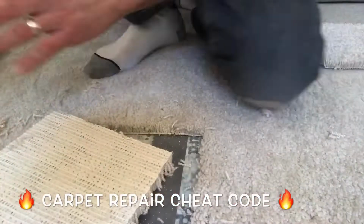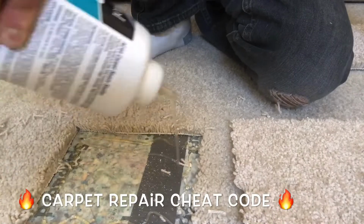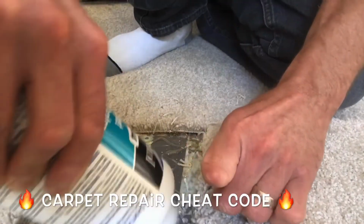in there. Once I traced it out with the screwdriver, I took a razor blade and traced that line to get a nice clean cut, and then I put the square in there, as you could see, and traced that out to make it a perfect fit.